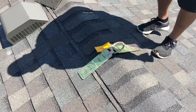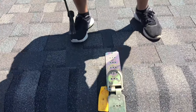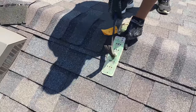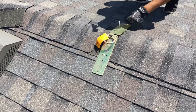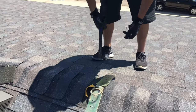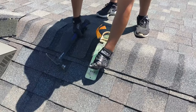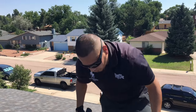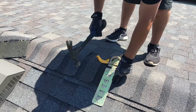One way I found the rafter is that the plywood has a little bit of give — I was able to find where the center was. Once you've found it, you want to make sure you secure it on both ends. This is what's going to keep you on the roof in case of an emergency. You also want to stay away from putting nails directly one above each other, because you could split the rafter and it won't hold anything.